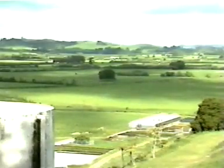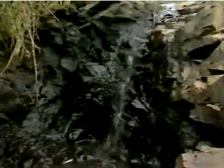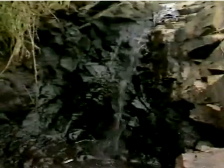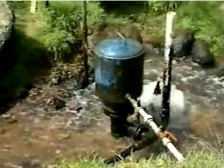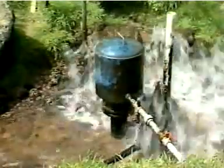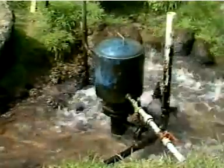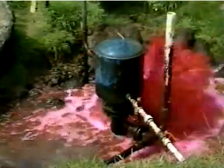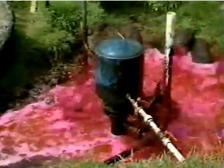If you've only a limited amount of clean water but plenty of dirty water, you can use this version of the Williamson RAM pump. The clean water is piped in through a special port just below the store valve. To demonstrate how well it works, we've added some red dye to the main supply of dirty water. As you can see, there's no contamination of the pumped clean water.